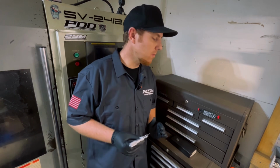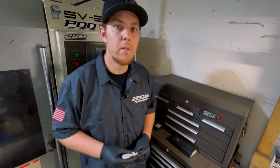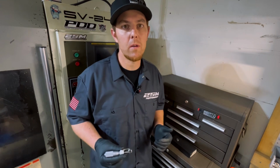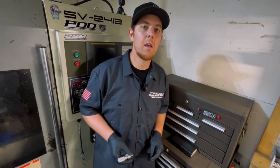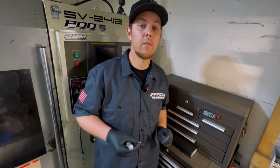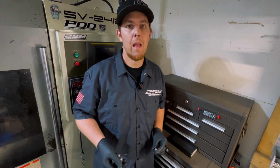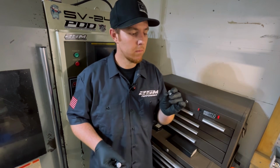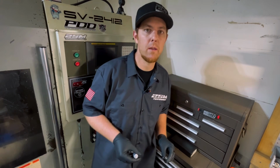I really don't use it too much anymore, but at a job shop I worked at, we used to do a lot of aerospace and semiconductor work, and we did these semiconductor parts out of heat-treated Inconel 718. They look like this. Now, a lot of these parts had a very specific bolt circle and positional callouts for GD and T with a maximum material condition, and we used a CMM to check them to make sure the parts were good after each first article was set up on the machine.